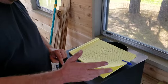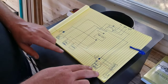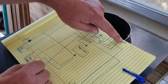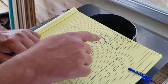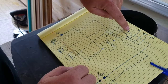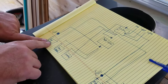So let's hone in on this. This is going to be the rough draft because we still need to put in some cutoff switches at the battery itself. Your motor battery, which will be charging off of the outboard, will go to the distribution block for all your boat needs — your navigation interior lights, exterior navigation lights, and so on. This distribution block will divvy out positive and negative. On the negative side is where we'll meet your solar battery bank and your motor battery bank. On the top side where the motor battery comes into the distribution block, you'll also run a line to a battery isolator, and on the other side of the battery isolator, also positive, it'll run to the solar battery bank.